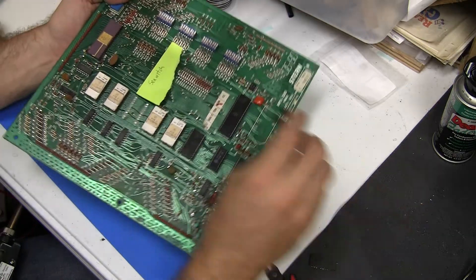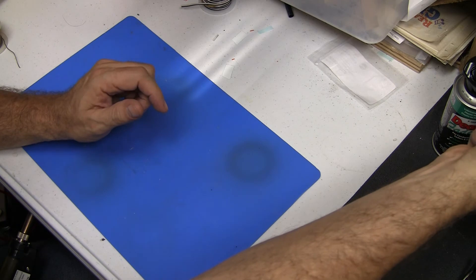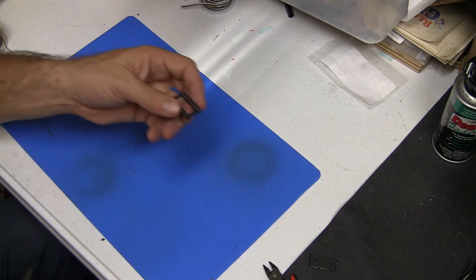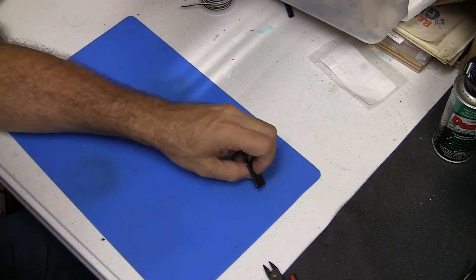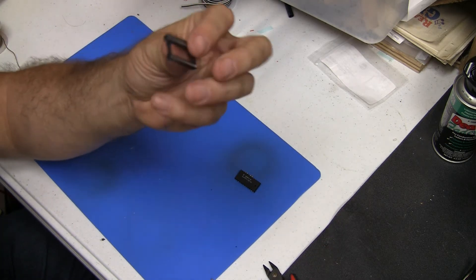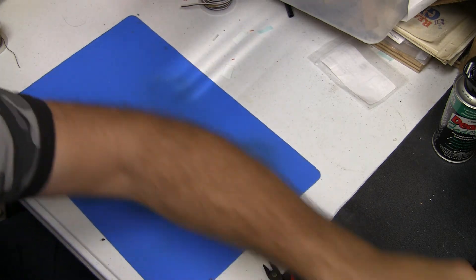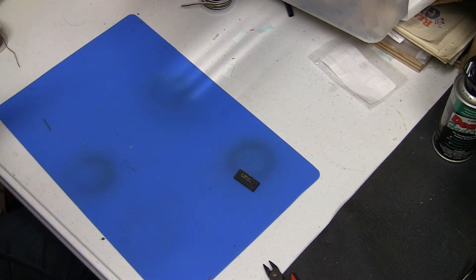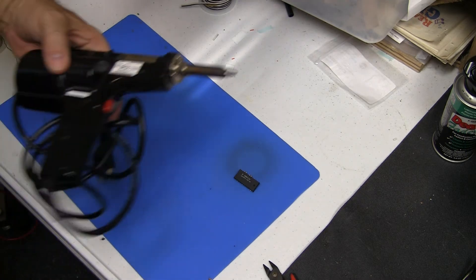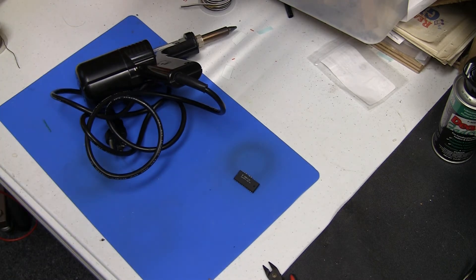That's how you get it off. Once you have the chip off, fully take a look at it and make sure that it's all clean. Take some small sandpaper, scuff the pads a little bit, put a little bit of flux on there, then take your 24-pin socket and drop that on and solder it on. Once you've got that, get the little non-volatile RAM and just pop it in — bam, you're done. It's fairly easy to do. You can get those non-volatile RAMs from a variety of different spots — they're very, very useful.